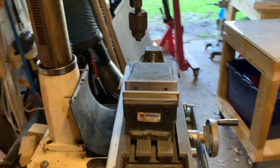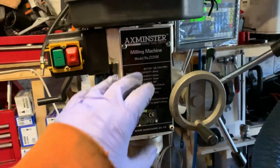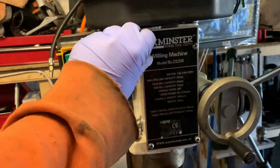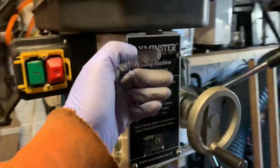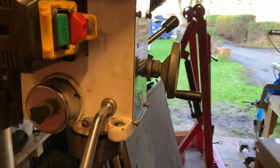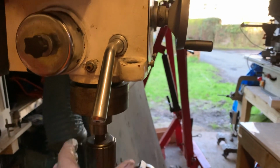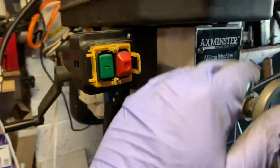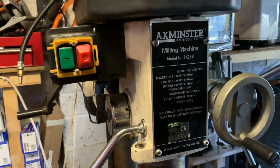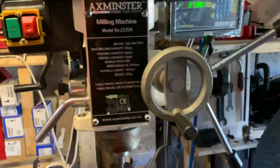I bought it with three axes because I've got this grand plan that I'm going to take this plate off and then mount the third one vertically here with a kind of slider adapter type contraption coming down here and then locking to the top of the quill, so that when I move this up and down, the theory is that we'll get a Z measurement up here as well. I say that's the theory, who knows when I'll get around to doing that.